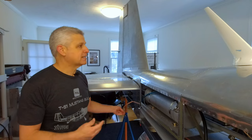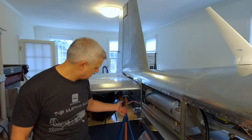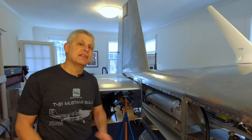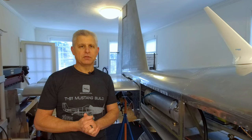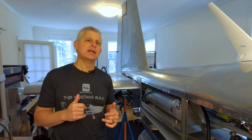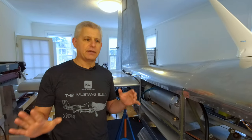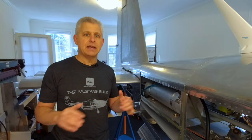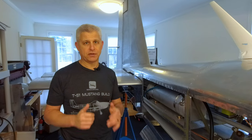Based on all of that, we're using our Comant antennas and we will have blade antennas going in right down here — very similar to what you might have seen on aircraft like the V-tail Bonanzas, which tend to use these blade antennas in that same type of position. So it's an approved location and it works very, very well.